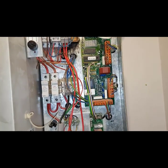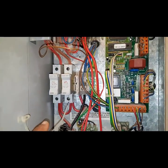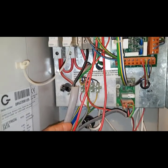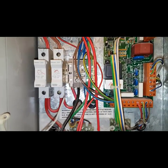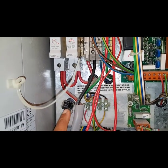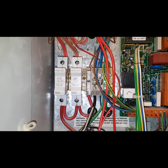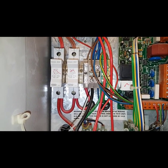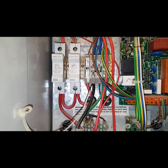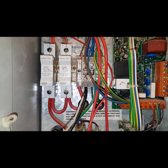So Mark, we'll come here. This is the main fuse — this is the cable coming in here. You can see the black which is neutral and the red which is live, and it goes through these two fuses. That wire basically splits between the two fuses. So all we're going to do is go across your live and neutral sides — your red and your black.